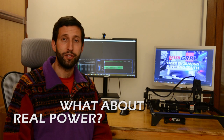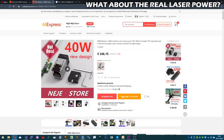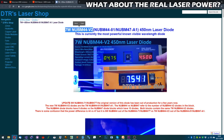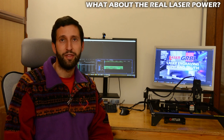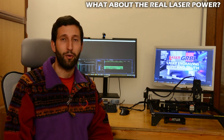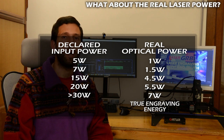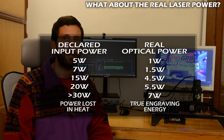What about the real power of a laser diode? We can find laser modules up to 40 watts, but the most powerful diode in the visible wavelength is only 7 watts. Sellers are smart and try to attract buyers with higher power and lower prices, which implies lying about true power. The true power is the optical output from the laser. The power declared by sellers is the electrical input power, which includes conversion losses due to driver efficiency, heat loss, and often the current used to power the cooling fan.